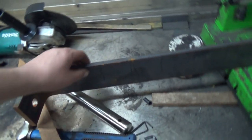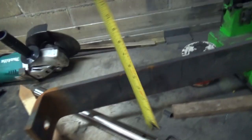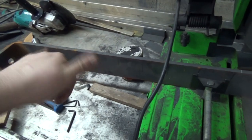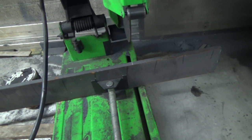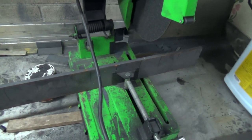Alright, so I forgot I had this stuff that Iron Man gave me one time when I was down visiting him. I needed some 1/2 inch for something, and this stuff's a little wider than I wanted. I only wanted really a 3 inch, but this stuff is 3 and looks like 3/8, so that's a little wider, but that's okay. That'll just add more durability against wanting to tear off, so the wider she is, the better. Basically what I want to do is bend her right around to the dimensions of the U of that thing. So I got one cut, pretty wicked hot, so we're gonna cut this feller here, and then get these two centered, like the center of the dewey, so I know where to weld it on, and then heat her up and see if she'll bend around for us.